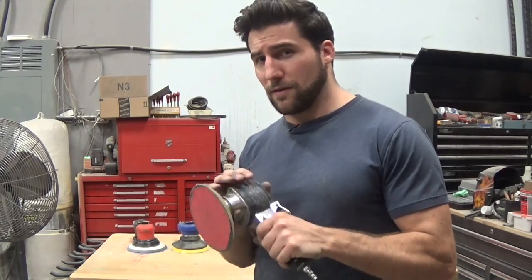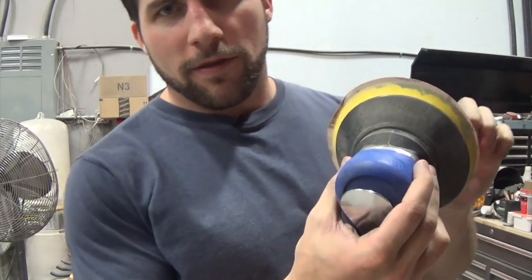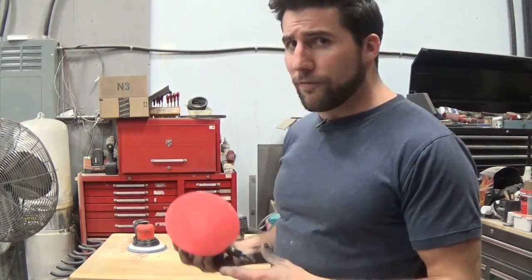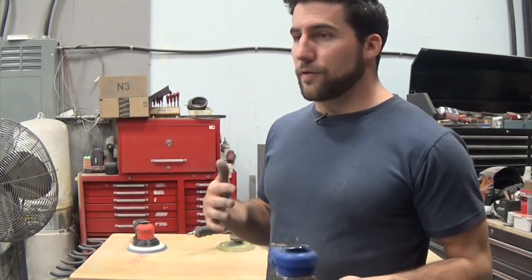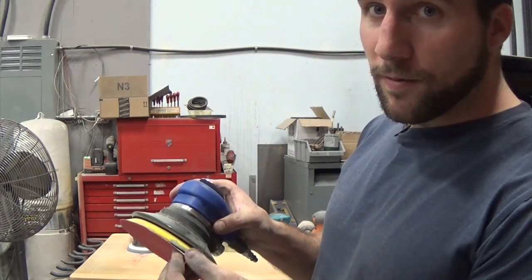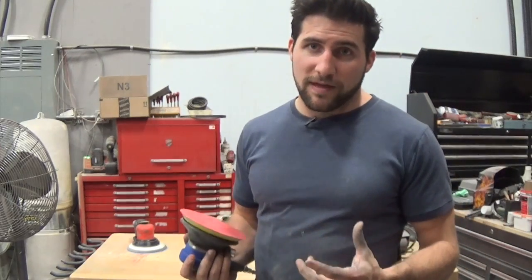It's not my favorite for getting into curves either because it's a little unwieldy and doesn't really flex. Here we have another dual action random orbital sander — this pad is spinning and moving up and down. It doesn't have the same kind of torque as the other one, so if you're pushing, it's not going to keep spinning if there's resistance, which prevents you from gouging or taking too much material off. This is basically a finishing sander — you can use it for finish sanding wood, and it's designed more for finish sanding filler and finishes. It works great for both, but it's not my favorite because it has a stick-on pad, which is a pain to change back and forth.